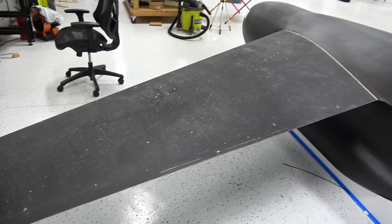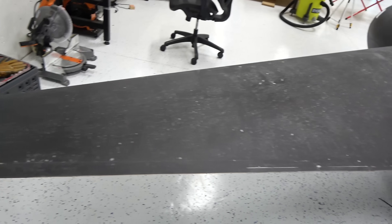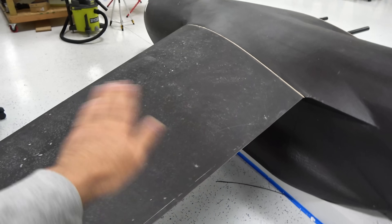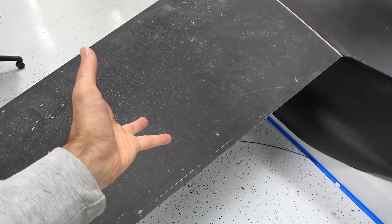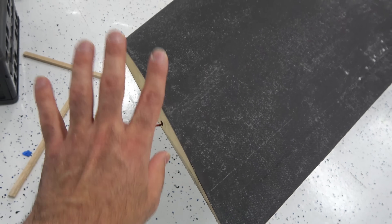This is the left wing just out of the mold. We put around 1,400 or 1,500 pounds of weight on top of the mold to press it, and it turned out super nice. This is two layers of carbon, top and bottom, and on the top there is a layer of fiberglass. We really did not soak it enough with the epoxy, at least the fiberglass, because we did not wet or soak the peel ply on top of it. I thought, save some weight, but this is not bad. This fiberglass may be sacrificial because this is not the final surface — it's going to be sanded. Most important is that the two layers of carbon fiber, which is the main strength, are fully soaked and pressed really well. Here I have this wire for the lights and the wing tip is being cut at the moment.